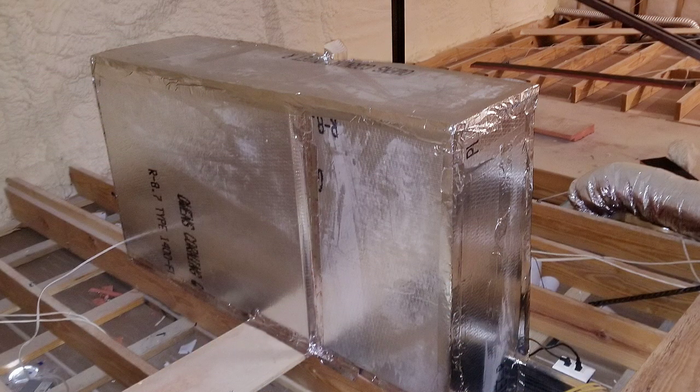At the end of this video there's going to be a link to the next video where we're going up into the attic, swapping the old mount for this one. I'll show you how to mount it, how to tell if you can mount it by looking at the joists and their direction and size. I also have spray foam insulation so my attic is temperature controlled, but you still need to insulate around the unit — basically build a little igloo or cabinet around it. It's a very simple method any DIYer can do using a steak knife and foil tape from the HVAC industry to build the enclosure.